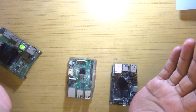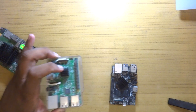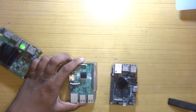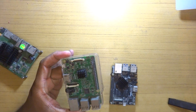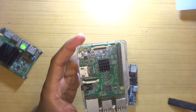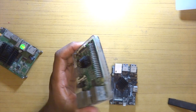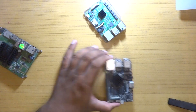The other issue is that even with max USB current settings, the USB ports don't have enough juice to power an external hard drive. I have lost at least two Raspberry Pis from power failures — one of the chips gets extremely hot and then the Raspberry Pi stops working. Two of my Raspberry Pis have died from directly powering an external hard drive from the board.